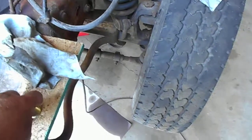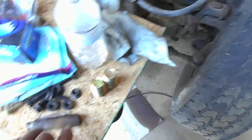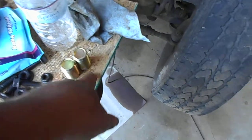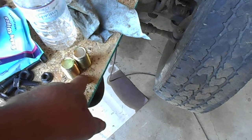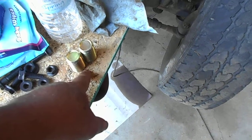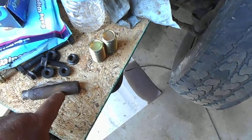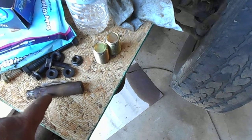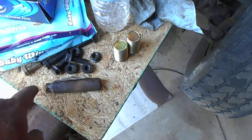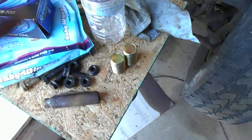The bolts that I bought yesterday — this is what remains of them. They're being made into this now. He got the heads cut off with the turn down on the lathe and turned to the right diameter. He's going to step them and thread them later tonight.